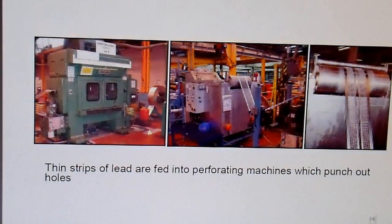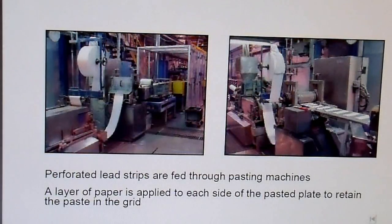If you just have a solid plate of lead, its surface area is very low, so it ends up with a very high internal resistance — that makes it a not very useful battery. So you need to do something with it. In this case, they perforate it. You basically make a punched sheet with corrugations, which allows you to have more surface area and better hold the paste, which is the next step.